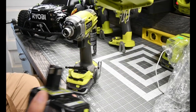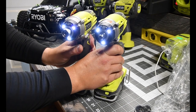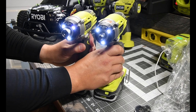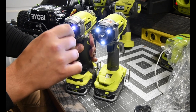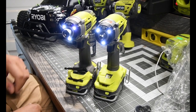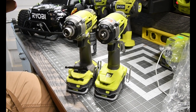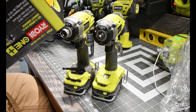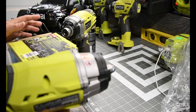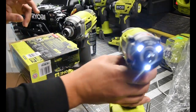Replace that with that, and there you go. Let's see if there's a sound difference — and there actually is a sound difference. This produces 100 foot-pounds of torque with a 3/8-inch square anvil and 3,500 impacts per minute. It has a three-speed selector — one, two, three — and yes, it is variable speed.